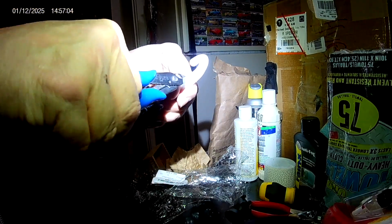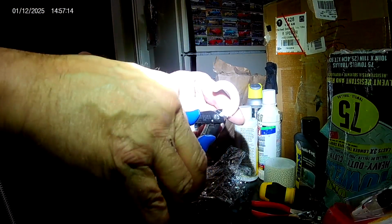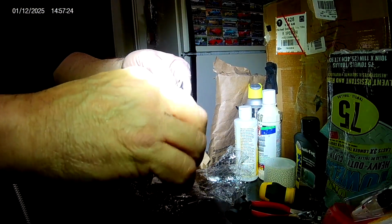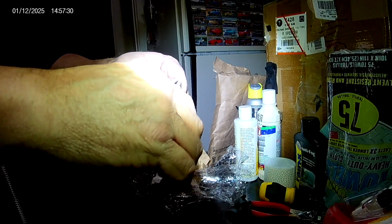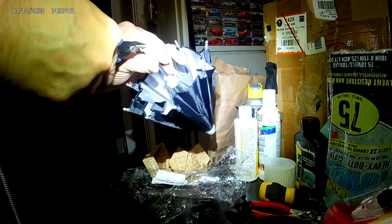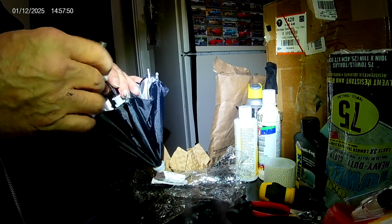I mean, a hacksaw blade. Now when it gets to the edge like that, you're really, really tempted to just break it off. I wouldn't do that because it would fracture. There's a chance. Now I'm going to use my little cutters here, get off all the edges. Okay. Now you notice, oh, there's a big glob of glue in there. Okay.